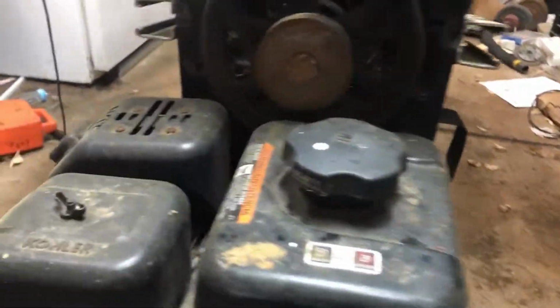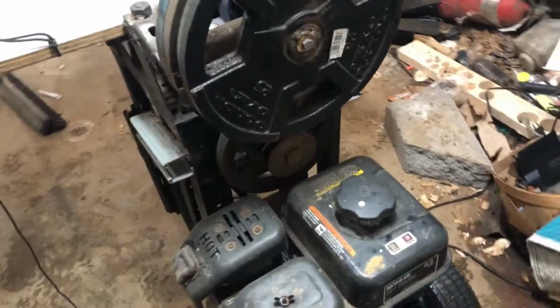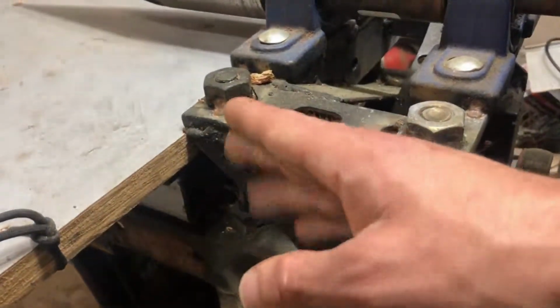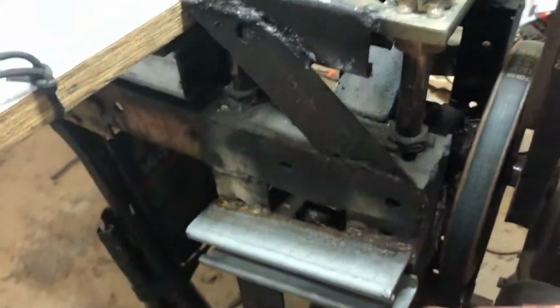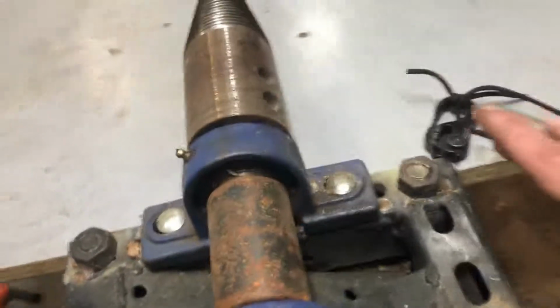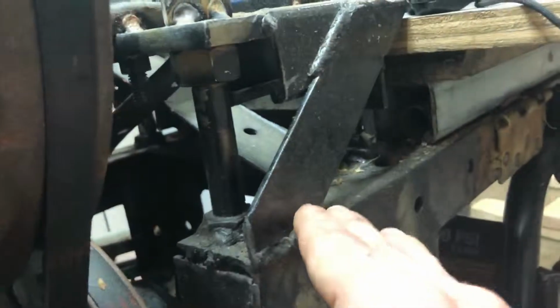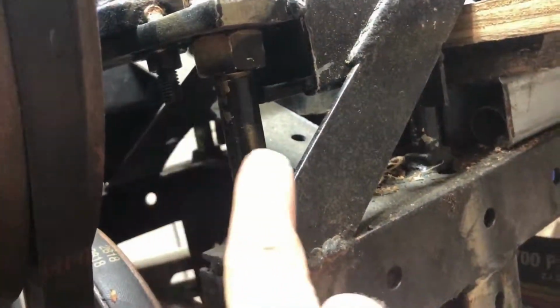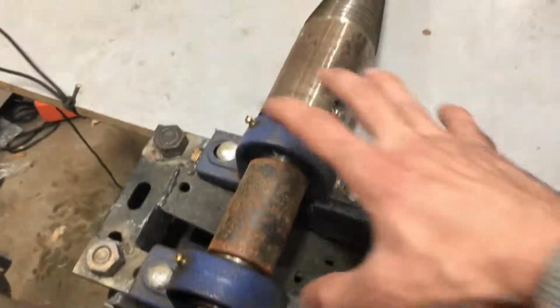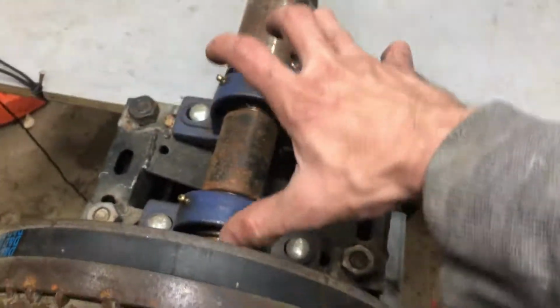So it took quite a while to build this thing. Simply, I was waiting on that screw. It took forever, and you can see I braced this with a ridiculous amount, and this is actually directly over the supports. This all goes through here. This is 1/2-inch plate, and there's cross members there, angle iron here, but it's there to make it sturdy because all your force is right here. This is going to want to rotate, and it's going to want to go every direction you don't want it to go.